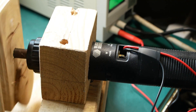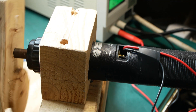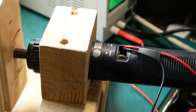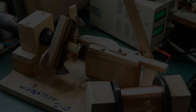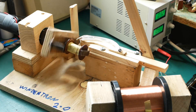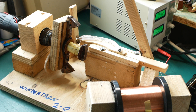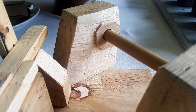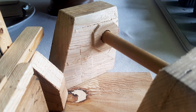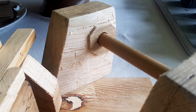The drive unit is an old electric screwdriver with the dead batteries removed, powered from my bench power supply with a foot switch so I can have both hands free to control the wire feed. I had a couple of false starts — the initial half layer went okay but when I went in the other direction to do the first full layer the wire broke. After the second failure I figured there was too much drag on the sides of the wire reel, so I quickly hacked away the wood from the roll holder so it only contacted in the center, and that did the trick.